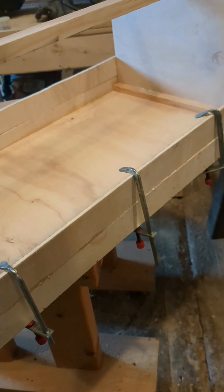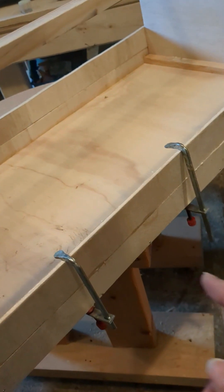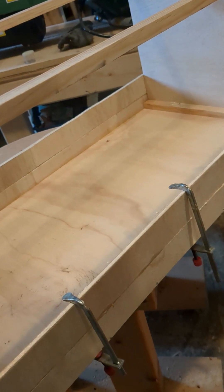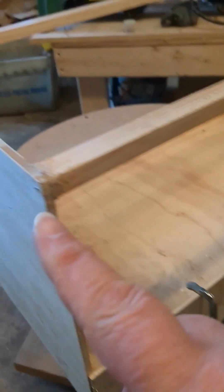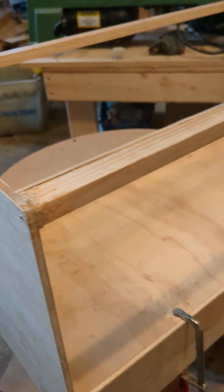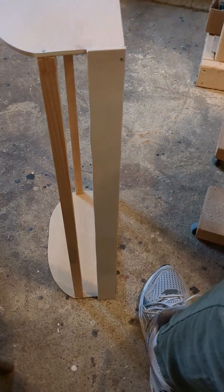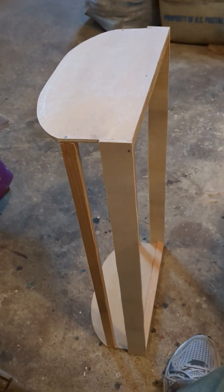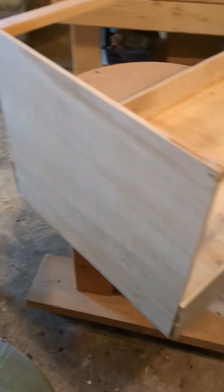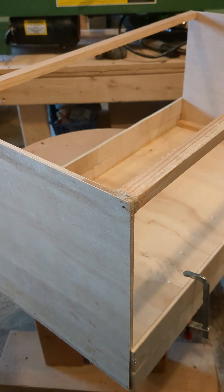There I am still going up the sides with slats. Because there's no support really in the middle, I've used little clamps to pull them together while they dry. There'll be gaps that show up later — even after the glue dries there'll be some gaps, and I'll do this again with the wood paste and fill in the gaps, kind of like mortar. And over here is the top, and I've already put the first slat on the top. It'll go up and around, so we're making progress. I have to force myself to stop and let this dry before I move on, because it becomes too unstable with all this wet glue in the wood slats. They're thin, so if I do too much it just makes it too unstable.